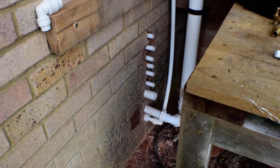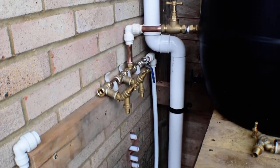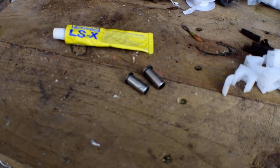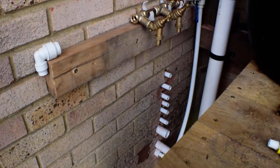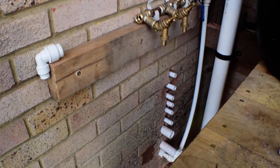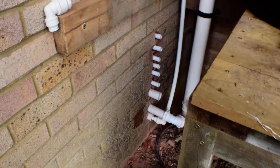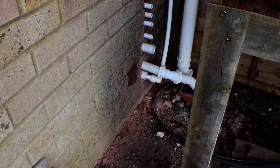If you're ever doing any stuff with this plastic pipe in the 15 or the 22 mil, it's nice and easy to take apart and things like that, so that's why it's quite good. But just remember you'll need these little pipe inserts here — these two silver ones. They slip into the end of the pipe before you put the fitting on. It just stops the pipe because there's only little teeth, so if the pipe expanded or contracted with heat it could blow off. Probably wouldn't under this, but on mains and heating systems and things like that it would. So that one will be connected up to the water butts at the front.